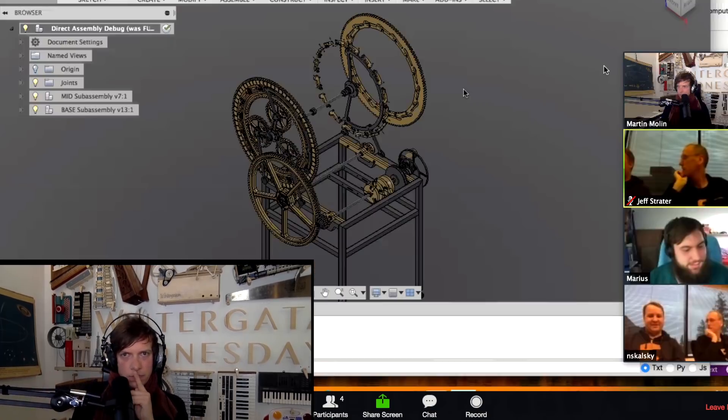Once the assembly is done, you can just refresh components when their geometry changes. The key idea I came up with: what if we build the large sub-assemblies at their correct position in space, so they have the correct relationship to the origin point? If we create seven sub-assemblies starting at the correct relationship to the origin point and use grounding within them, then when we do the top-level insert, everything should just be where it should be.